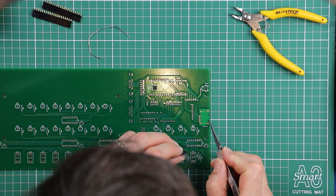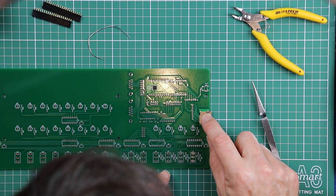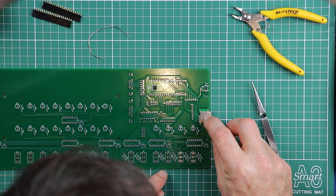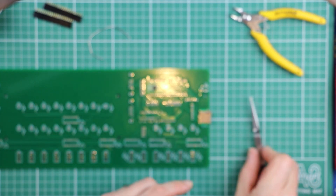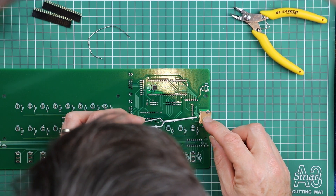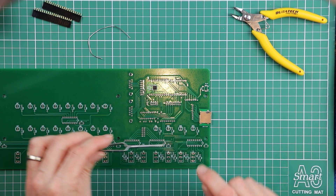On the circuit board you can see there are two machined holes ready to receive those two little pins. Just put it down in approximately the right place and wiggle it around until it drops into place. You'll notice that gives you almost perfect alignment — there's less than a millimeter of wiggle room in each direction. But you do have to concentrate on looking down the side of the socket to make sure those tiny pin leads are sitting right in the center of each of the pads on the circuit board.